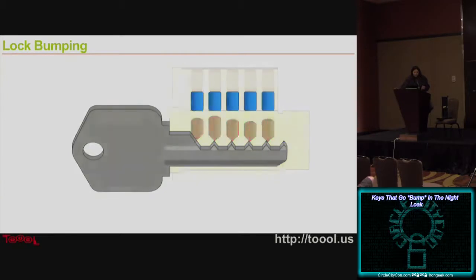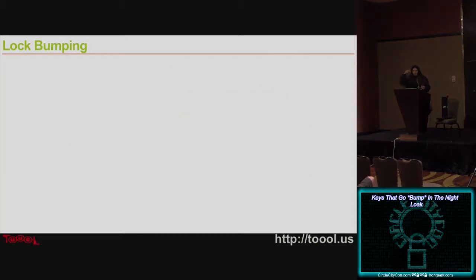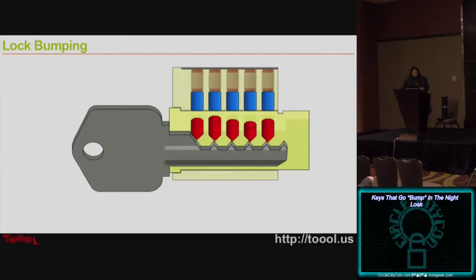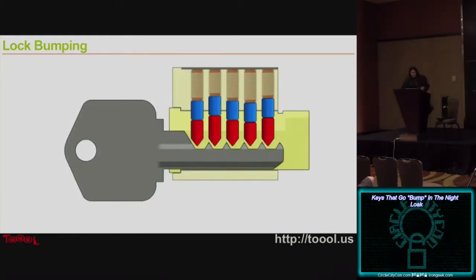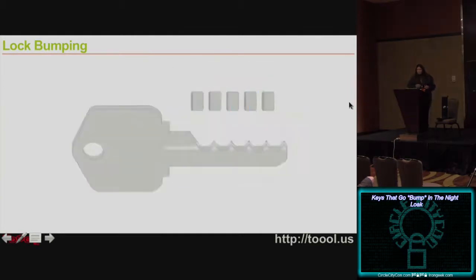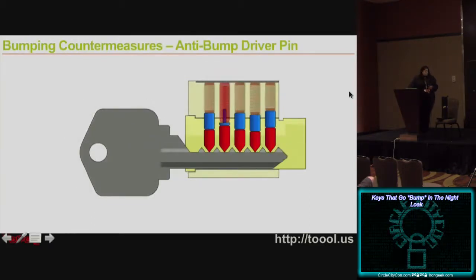It also shows that when there's tension on the lock in a direction and not everything is above the shear line, we call that a bind. One of the keys here is that with bump keys, the binding doesn't matter anymore. If you're actually going to pick a lock and lift it, you go through and feel each pin stack to find out which one binds. The point here is there's literally minimal skill involved. But now that I say that, we'll have the demonstration effect later.